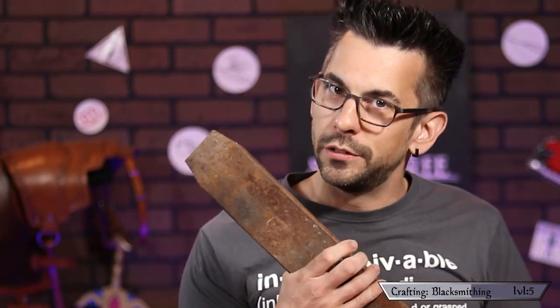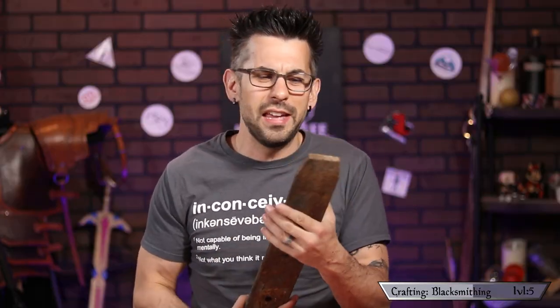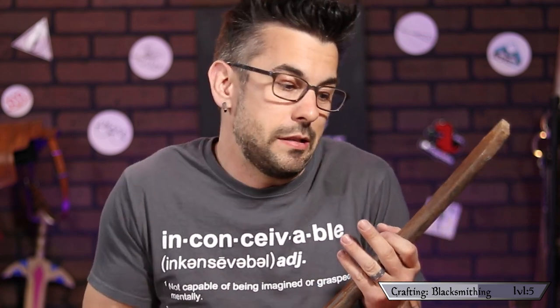With the shaft done, I moved on to forging the head. I was heartbroken to find that the metal scrap yard where I usually source leaf springs or steel no longer lets me scale the piles of rusty metal — something about liability and tetanus. Fortunately I did find this bad boy out in the wild: really encrusted and gnarly, looks like it used to be a forklift tine. When I did the spark test it looked like a metal that can be hardened — actually pretty good quality. If you're confused by the spark test, check out the link in this video.